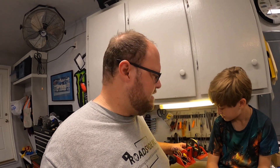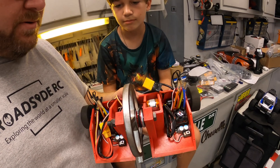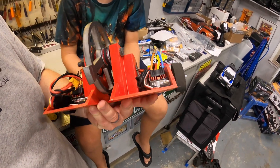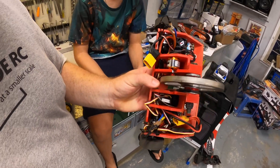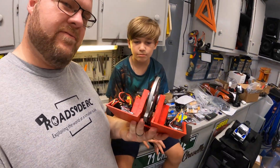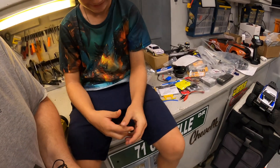We have 3D printed this chassis and put a big nasty weapon in it driven by a drone motor. It has some gear-reduced outrunner motors for wheel drive, and then it has some Hobbywing 10BL60 QuickRun ESCs to run those on either side. We've got it paired with our FlySky Noble in order to do tank driving, driving those two motors independently. What is this one called? Dragon's Breath — look at the shirt!